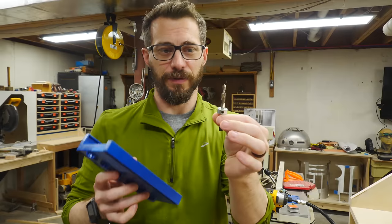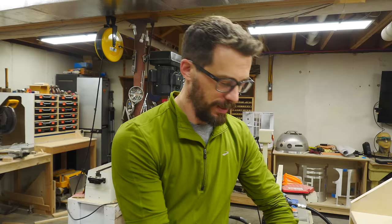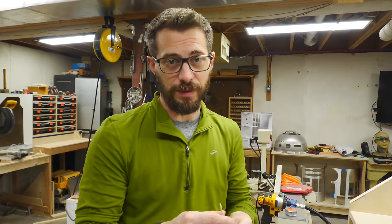We accidentally used the wrong bit for this — I grabbed the bit from the back of the shelf pin jig and it's way too big for the screws. So we're going to take these little slivers of bamboo, stick these in there, and then drive in some screws.